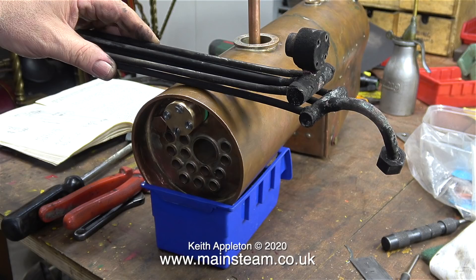If you look at the old wet header and superheater arrangement you can see how it works. The wet steam from the boiler, after the regulator, first enters a collector, and into this collector one end of each of the superheater flues is silver-soldered or brazed. Each of the superheater pipes from the wet header then goes all the way down the superheater flues and over the fire. At the firebox end the superheater tubes — made of stainless steel — are welded together and then return back down the individual superheater flues. Because these elements are over the fire they get extremely hot, which is why they have to be welded; silver soldering is no good in this application — the silver solder would just melt.